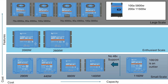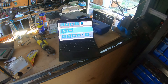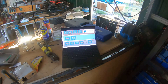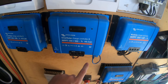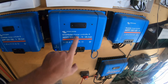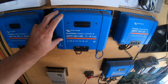Then there's a particularly special couple of units: the 450/100 and the 450/200. I don't have any of these — I did look at getting one, but there are some caveats. You're paying a lot more money, but the reason is they've got multiple MPPT trackers in them. So you look at this and think: I've got 100 amps here, but it's 100 amps on a single MPPT tracker. If I've split the strings and one panel gets shaded, we basically lose that string — we lose 22% of the output of the whole MPPT.